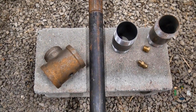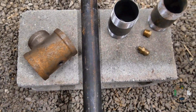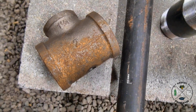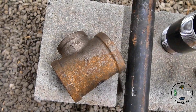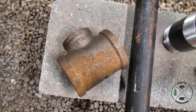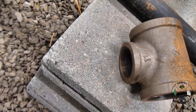For the homemade venturi, this thing couldn't be any easier. My pipe is an inch and a quarter, so I bought an inch-and-a-quarter to two-inch T. I wanted to make sure it's pulling plenty of air, which is why I bought the inch-and-a-quarter to two-inch T. That's going to screw onto your pipe and go into that inch-and-a-quarter pipe burner you just built.